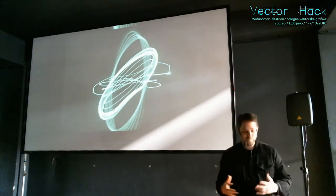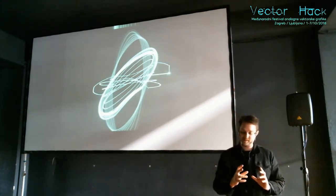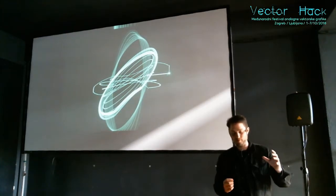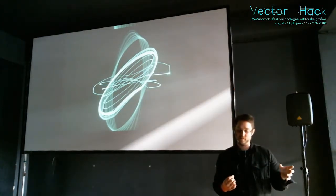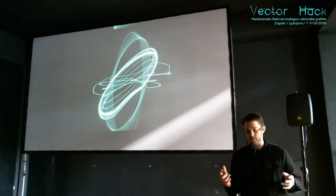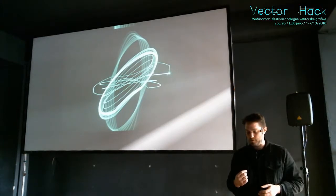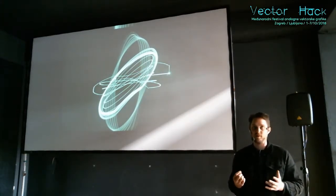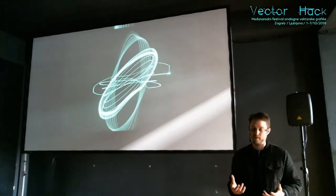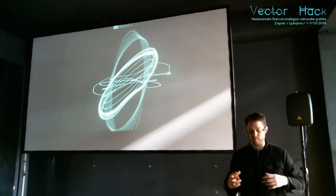So I started working on that, and I started to realize that it's very important to have standardized circuits, to have functional blocks that can work outside of the closed system. So I tried to make the Synth Shape VCO, and it doesn't lock very well. It doesn't synchronize very well. So it's not great. There are some weird old esoteric parts in it, like some complicated dual gang pots that have weird values. So it's difficult to update those things, and it wasn't a very good project for people to pick up and do, because you needed to source all these weird things. That's when I realized that it's important to have very common components, pots, and stuff that you need to bring in.